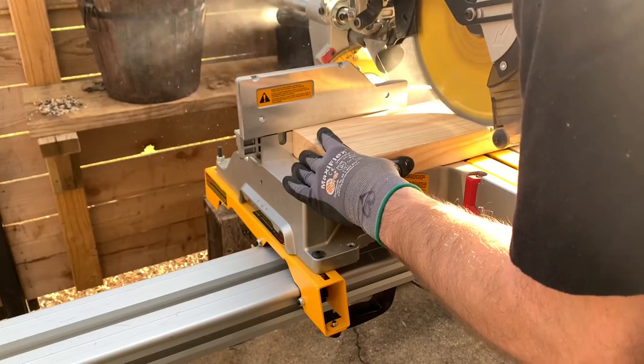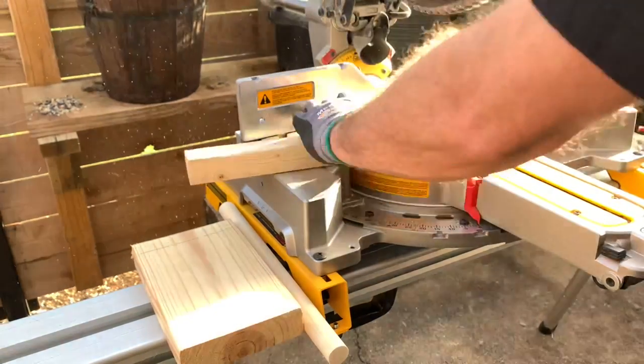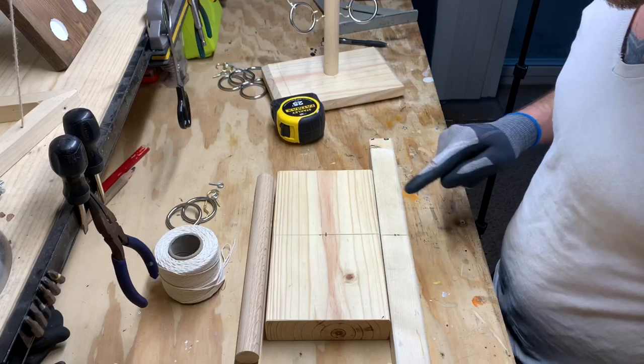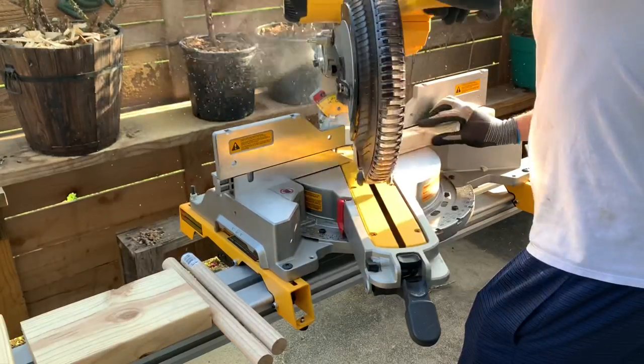I don't like to take a lot of time so let's get right to it. Using a two-by-six for the base, a one-inch dowel rod for the upright, and a two-by-two furring strip for the top, I will quickly make my cuts and mark the center of the top and bottom pieces. Then I will use the magical touch of a one-inch Forstner bit to drill a hole in the top and bottom pieces that is about three-quarters of an inch deep — this is where the dowel rod will attach.